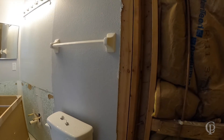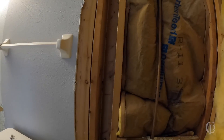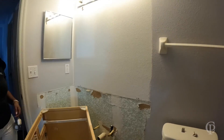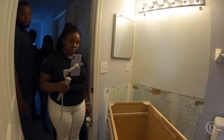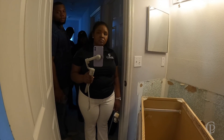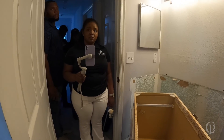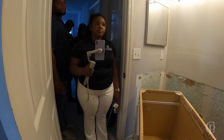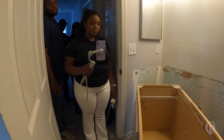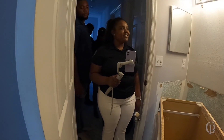So we're moving it up, and because of that we'll also be moving these up as well, at least to waist height so it's not at the bottom. The importance of removing these vanities is that the tile is 24 by 48. We want to minimize any cuts they have to do with the tile, because with a 24 by 48, if there's any errors you're wasting a lot of material. With these being moved, they can lay all the tile down and we can come back and place the vanities on top of the tile when it's all said and done, but it limits the cuts that are necessary.